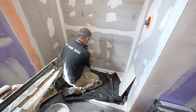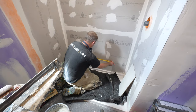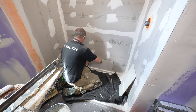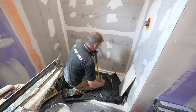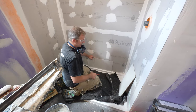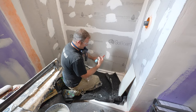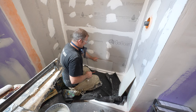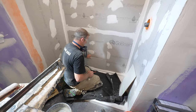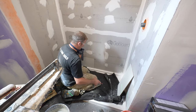And then just to extend this further down to the 16, it's just going to be the opposite on the other side. So 13 and 21 inches. So our smallest piece is going to be 5 inches in the corner, which works out great. I would say anything less than 4 inches on a wider tile like this is what's going to make it look a little forced, I guess you could say. So you can always offset your pattern a little bit more, but going center with the 12 by 24s is going to work out great.